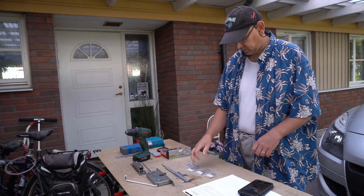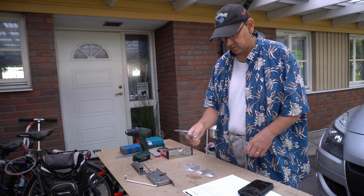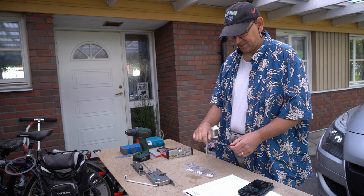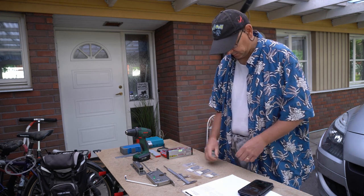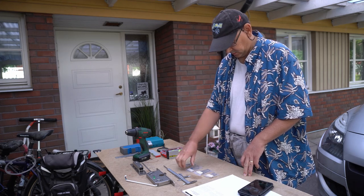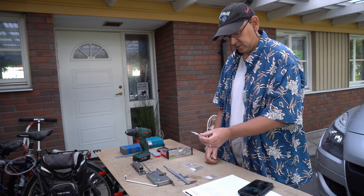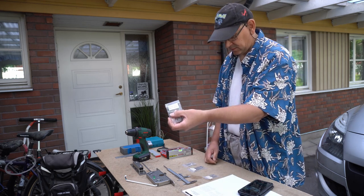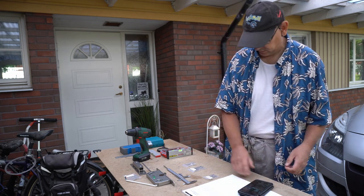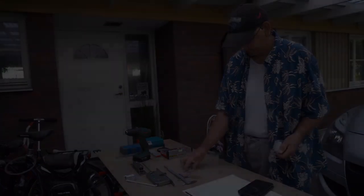But first, I'm going to filter away the screws that are not needed. I've measured the thickness of the door, and in my case it is 60 millimeters. So it's those screws. This one for my door, 56 to 57 millimeters. So I'll be using those, and I'll take the other ones away. So those are these 2 packages I'll remove from the scene.